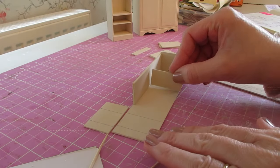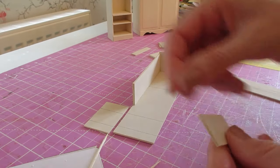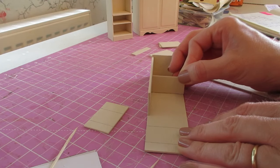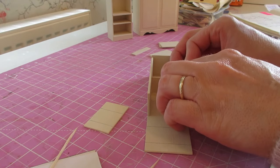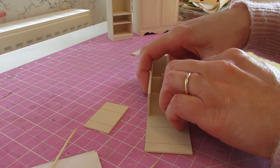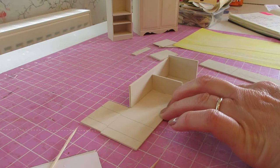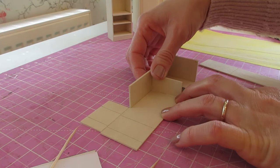Try again and see if you've got any little ridges. Apply glue to a long and a short edge, then sit that just above that line so you're hiding the line as well. Bring in your rule to act as a set square to make sure it's sitting straight along that shelf. Pop the rule in flat against the side and the shelf to get that straight edge.